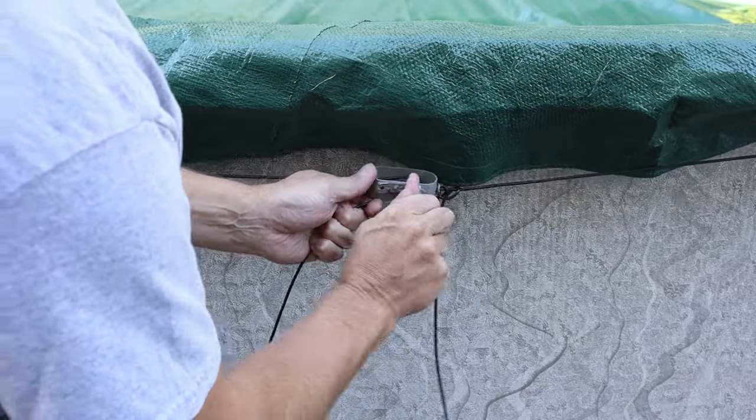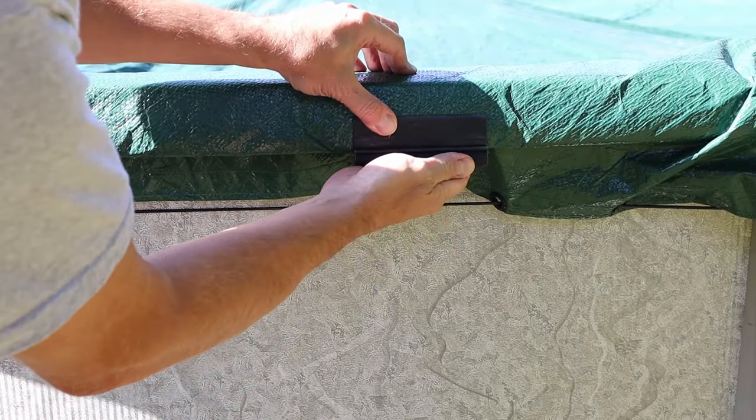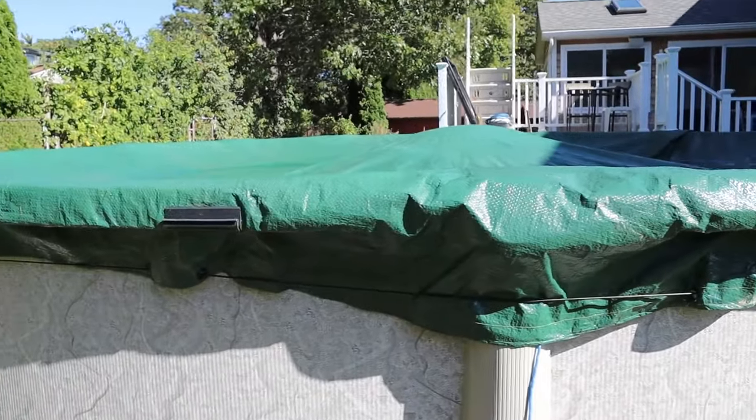The way to add extra security to your pool cover is to combine these pool cover clips along with your cable system. These clip systems advertise that they can be used all by themselves, but I highly disagree. My recommendation is to combine these systems so that you get a sort of double system to keep your cover on. These clips are very good at keeping your cover snug to your pool edge, which will keep the wind from getting up under the cover. It does happen where these clips pop off causing a weak area, but that's why the cable system is good for a backup. The cable system alone allows wind to get up under the cover because it only grabs the pool where the grommets are, which are about three feet apart. These clips will hold the cover tight to the pool in between the grommets, causing a better, tighter seal all the way around.